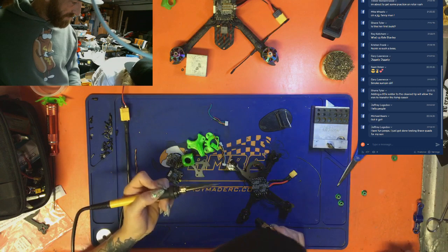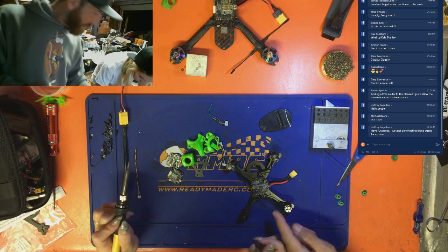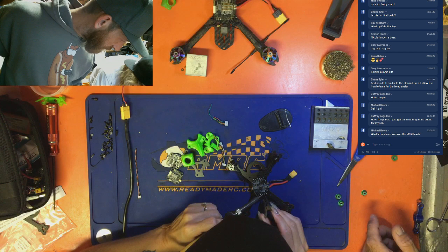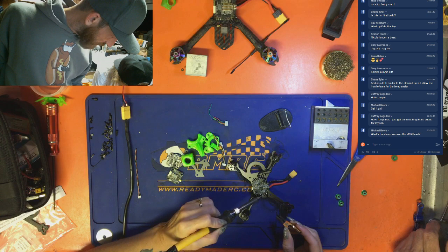You want me to redo that middle one, or you think you got it? Here's what I would do with that. I would pull it off, pull the wire off. Mm-hmm. Uh-oh, she got text messages. Yeah. Go ahead. Pull the wire off, and then there's some excess solder on there, and you get it off. So, yep. Now, take your soldering iron, kind of like put it on there and get it hot, and then just kind of wipe to try and get it to stick to the soldering iron. Yep, so now you see how it flaked off there? Try and pull that off.